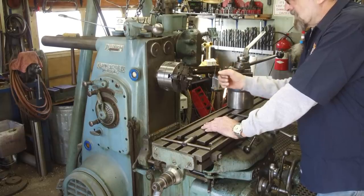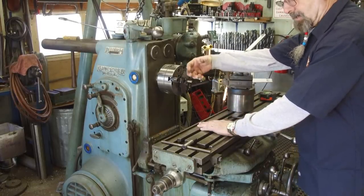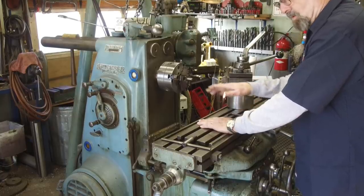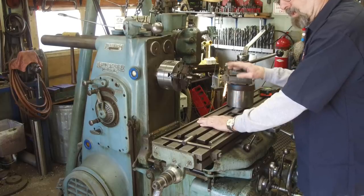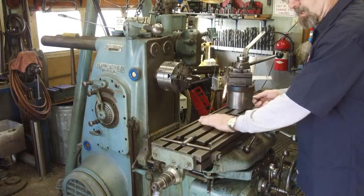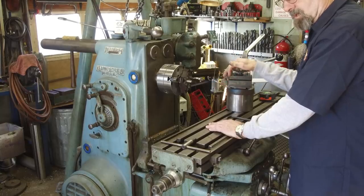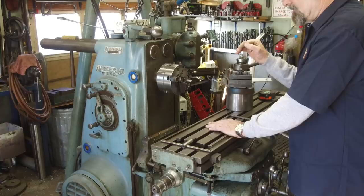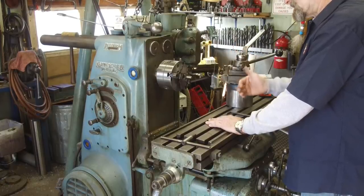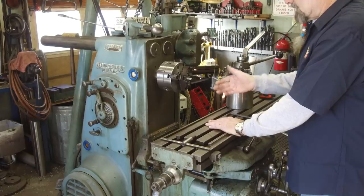And a lot of HBMs, you can mount up a chuck on them, and then you have a nice big moving table where you can place a rotary table on here. So you can chuck up on a component like a spherical steam valve or a spherical object that you might be machining on, and you can match or duplicate that radius in a real true smooth control with a rotary table. And you can even have some of the rotary tables with a small automatic drive on them and things like that to where you really get that smooth arc spherical cut. And very, very good cut quality on it and precision of setting that up. And that is one of many tricks that can be used on a milling machine with chucking capabilities.